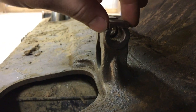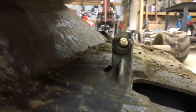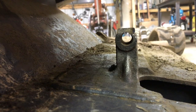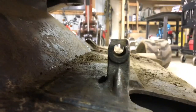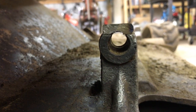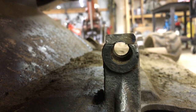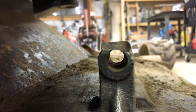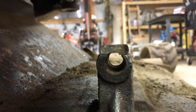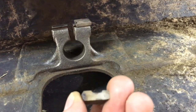So when you set it on there, you can see, try to go to the other side here. You can see that there's still a round hole there for the bolt to go through. And it doesn't have to be perfect. The bolt would just about fit through with a flat piece there, but I figured that would just be safe. Give me a little bit of room and I won't have to try to drill it out. The other option was to flatten the bolt, go along one whole length of the bolt and maybe shave a 1/16 of an inch off so it would be flat. That would still work. The nut wouldn't have full thread contact. So this was just an easy way with a grinder to make these, and like I said, just put a little slot in them there.